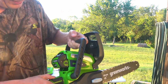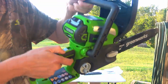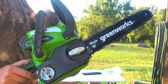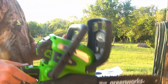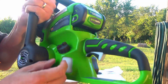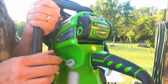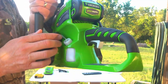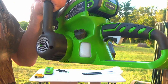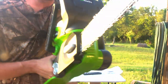I don't know why there's a lock/unlock sign on there unless it does lock the chain somehow. So it looks like you have a switch here to turn it on — no, you pull it and then pull the trigger to make it go. The battery's dead because I just got it. Here's where the oil goes — it unscrews and has a little lanyard so you can't lose the lid, and a little sight glass here so you can see your oil level.